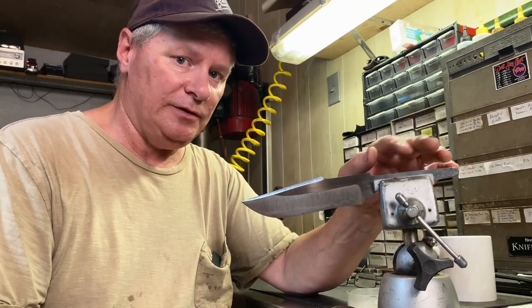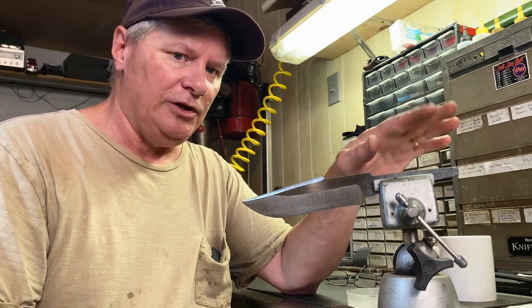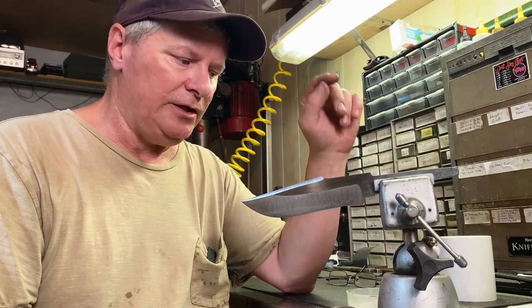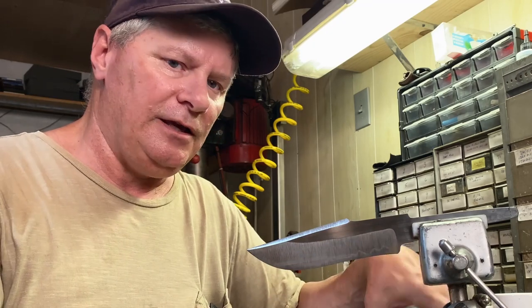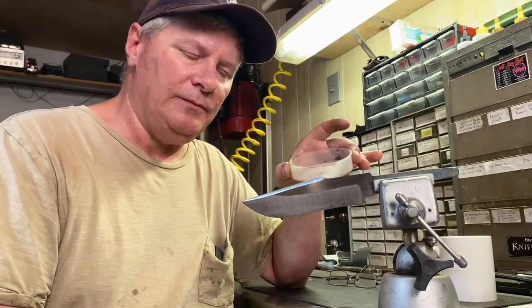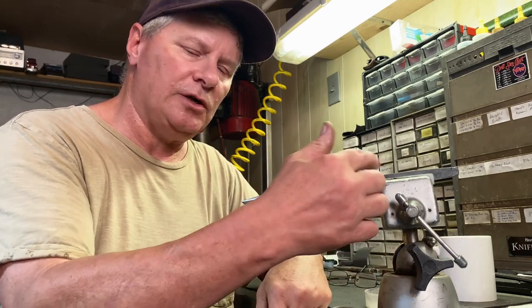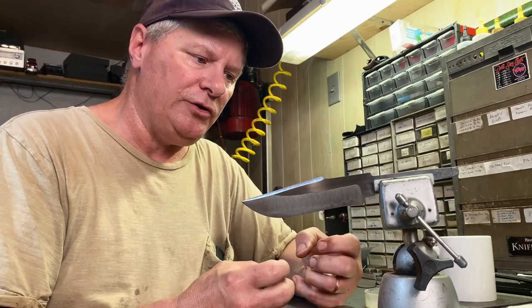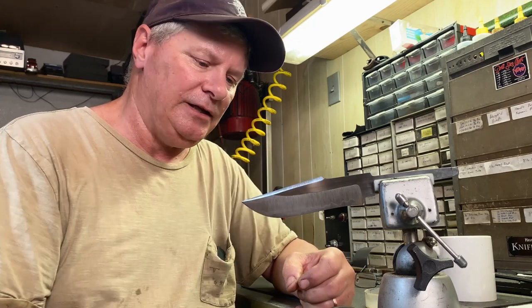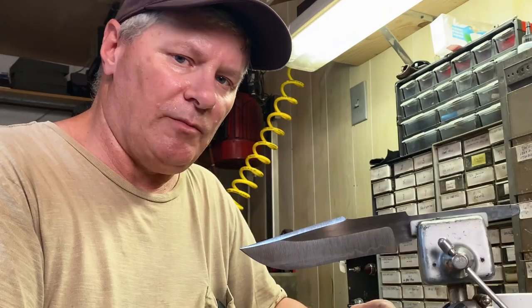Now, this may not ever happen to you, but when it does you're going to want to prevent it — you've already put a ton of work into a blade. This is how you do it: do the rough grinding, which eliminates a lot of the jacket. Then take some refractory satanite, make it into a paste, and apply it to the spine, the ricasso, and around the tang area. That helps keep those three layers at a more uniform cooling rate, at least where you've applied it — and in these thick areas is where you want it. I haven't had any problems since I've done that. So I'm going to make a paste, apply it to the blade, then we're going to harden it.